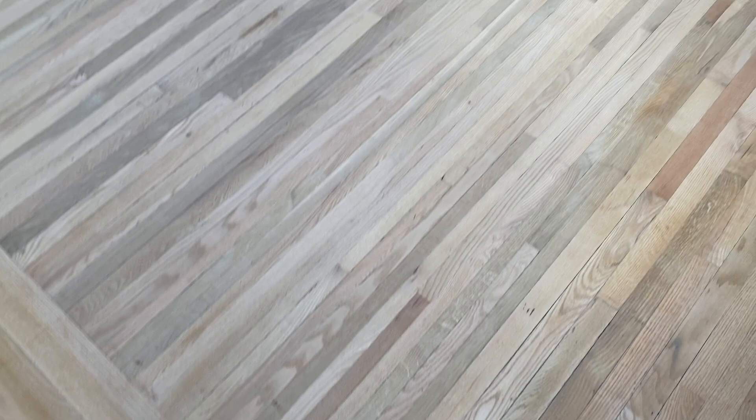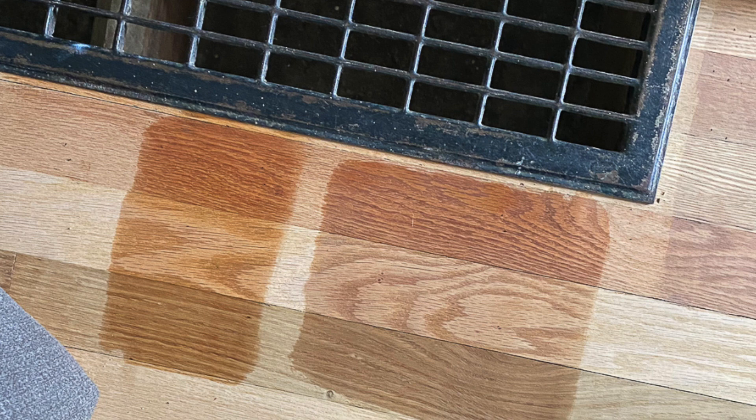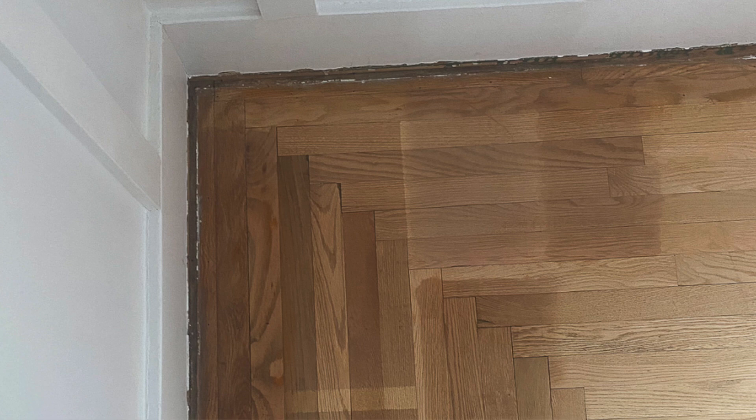This was quite the adventure staining our red oak floors. Every single stain combination I tried brought out the pink tones and the red tones in our floors, and I wanted to find something that was going to neutralize those warm tones. So I did some research — my mom actually helped so much and found out that if you want to neutralize those red tones, you've got to pick something that's on the green side, which sounds kind of crazy.